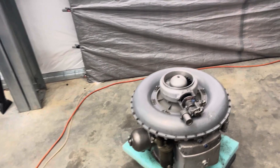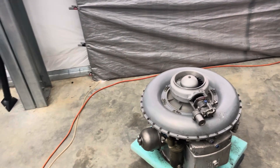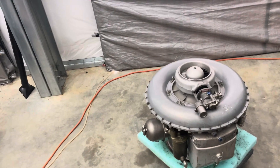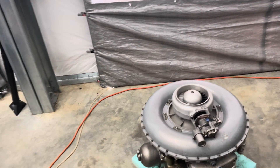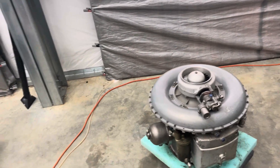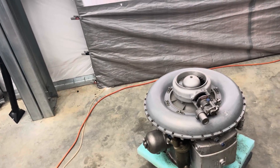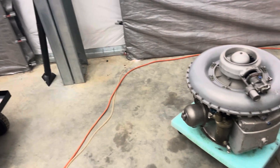I'll take the new individual blades and retaining clips, weigh out each blade, and mark them with their respective weights. When we go to affix them to the wheel assembly, we'll balance the weight out in an opposing configuration based on those weights and get them as close as possible. Then we'll put it on a static balancing stand and get it close. I've done that in the past with success, but you never know what you're going to get when you go that route.